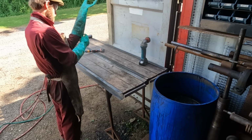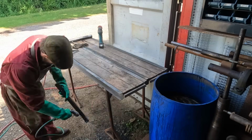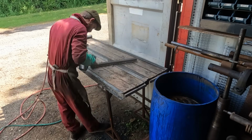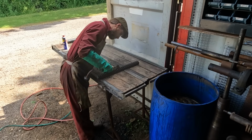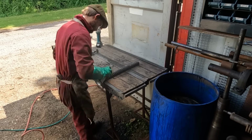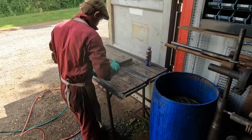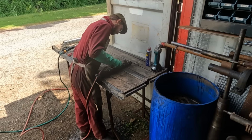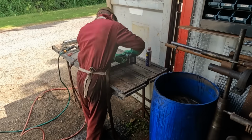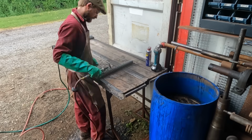Now fast forward again another 2 weeks and the parts have had a full month in the molasses mix. It's time once again to pull out the parts and give them a thorough rinse and clean. I find that a combination of an angle grinder with a cup brush and a die grinder with a mini wire wheel work wonders for this kind of cleaning. The grinder is perfect for covering large areas quickly, while the die grinder is ideal for reaching the troughs of gear teeth and other small spaces.